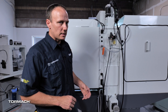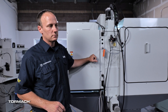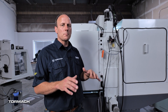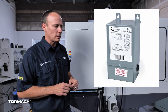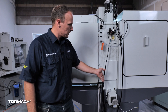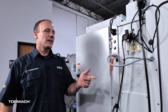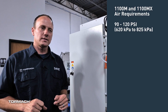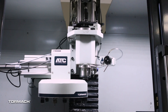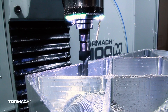Another consideration for planning your space is the fact that this is a 220-volt single-phase machine. It'll accept 208 to 240 volts AC, with some power difference in there — we offer a buck-boost transformer if you need it. The power cord is six foot long, comes out of roughly the center of the back of the machine, and has a NEMA 6-20 plug on the end of it. You're also going to want to pay attention to the 90 to 120 PSI air requirement. You'll need shop air for the power drawbar, automatic tool changer, and mist coolant if you get that.